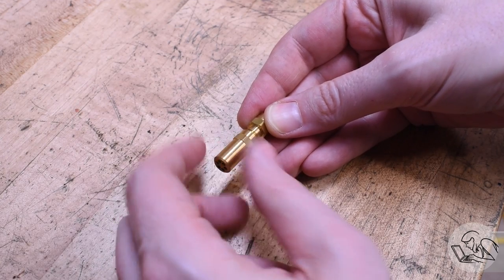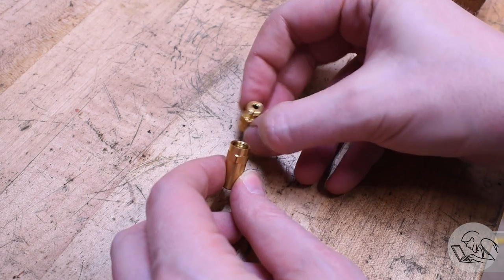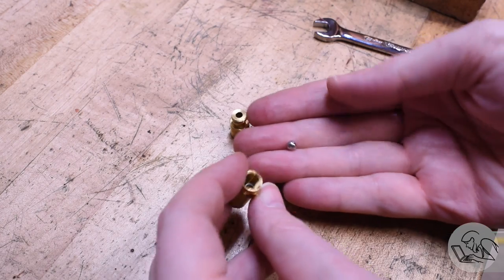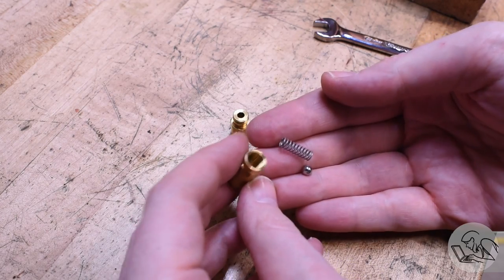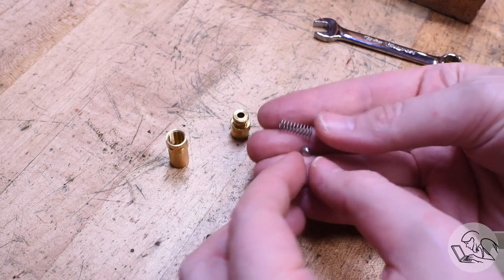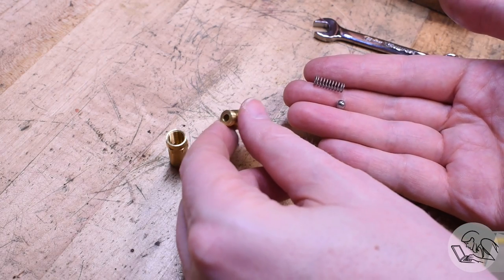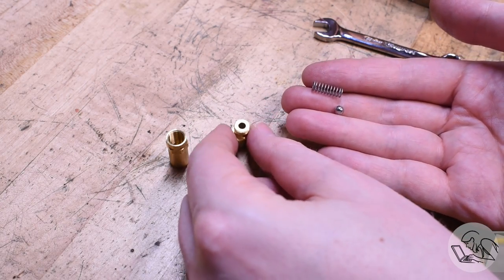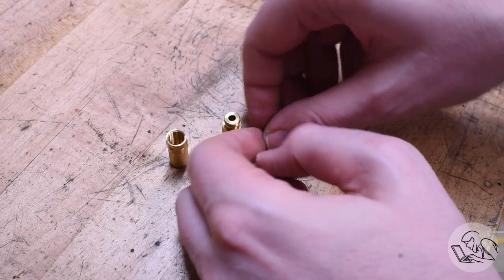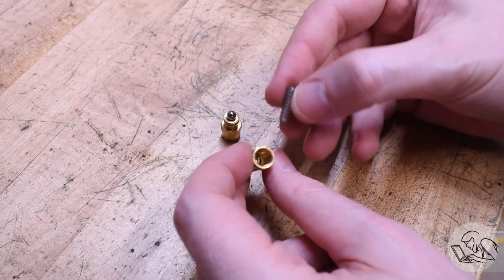Let's see what is inside this thing and how it works. And the answer is it's extremely simple — it is literally just a stainless steel ball and a stainless steel spring. That's all that's in there. The spring is presumably calibrated for about 60 psi. This is the very simplest form of safety valve, and it does work for what it is, but it's not sufficiently sophisticated for the performance that I want. So it was time to take myself to safety valve school.